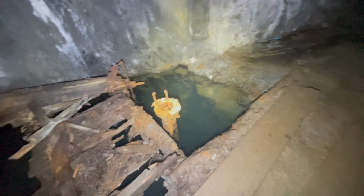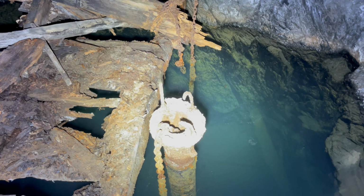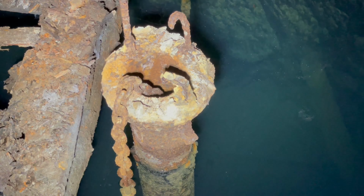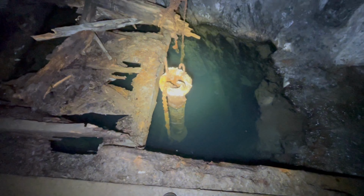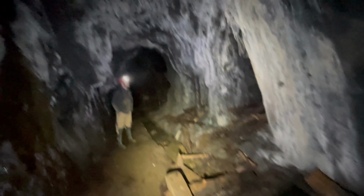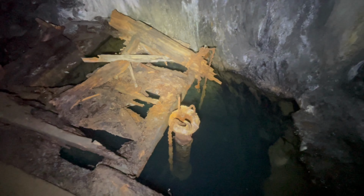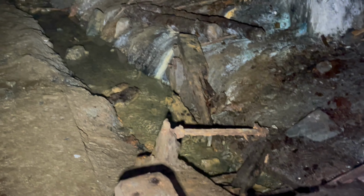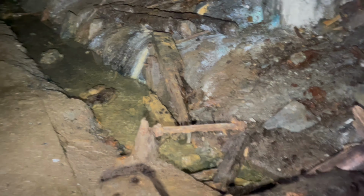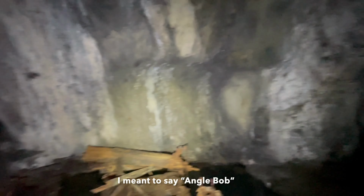in the shaft itself, the rising main, this was not a plunger lift pump like the Cornish style with steam engine. In fact, this one here would have had a series of buckets inside, so it would have been a bucket lift going all the way down, and the chain, with the motion of the wheel over there, would have been brought up and down the rising main, and then the water would have been discharged into the little channel just there. All this is rotted away, unfortunately, but in this space there would have been another one of these balance bobs, just like over on the other side.